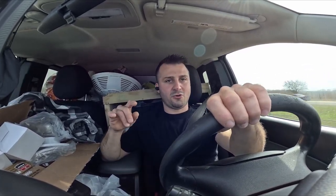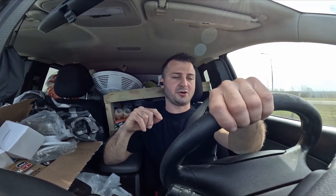it's a duplex, so there's two units next to each other. So there's water meters underneath in the crawl space. And I remember that wasn't grounded. You have the copper pipes on both sides of the meter, and there's usually a ground wire attaching it on both sides, because the water meter is not a good conductor because there's the seals on it. So I want to get both those meters grounded, or around the meter.